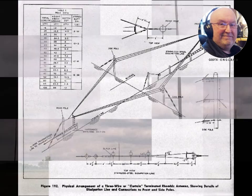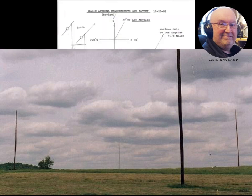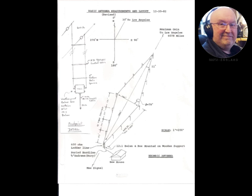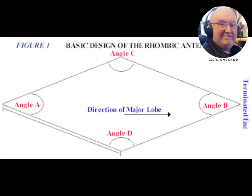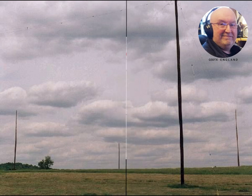The rhombic's input impedance and radiation pattern are relatively constant over a 2:1 range of frequencies, and its impedance can be made relatively constant over a frequency range of 4:1 or more, with forward gain increasing at 6 dB per octave. Multiple rhombic antennas can be connected to form MUSA — Multiple Unit Steerable Antenna — arrays, which can receive long-distance shortwave horizontally-polarized down-coming waves. The rhombic remains one of the least complex medium-gain options for sustained long-distance communications over point-to-point circuits.